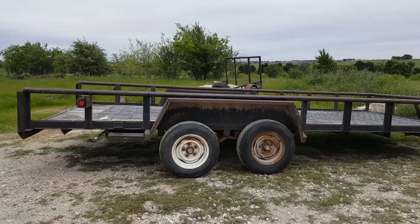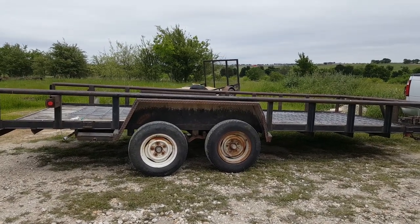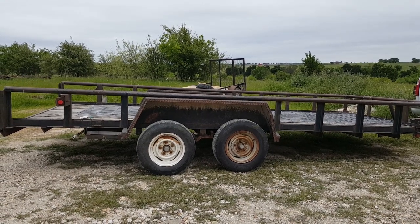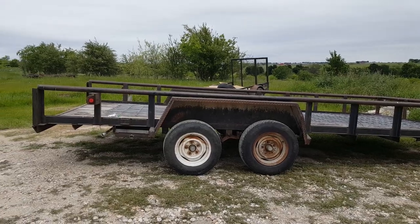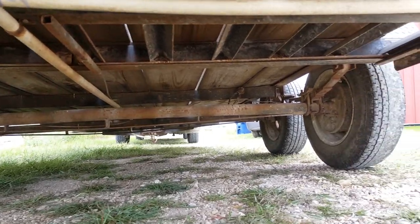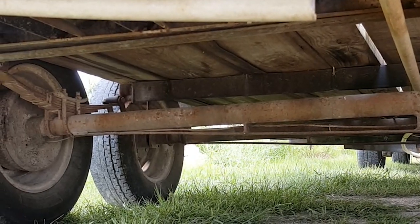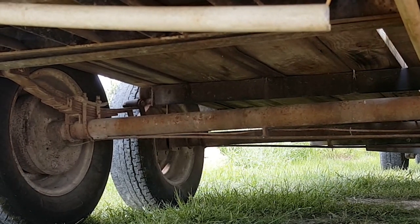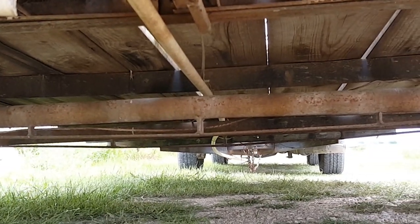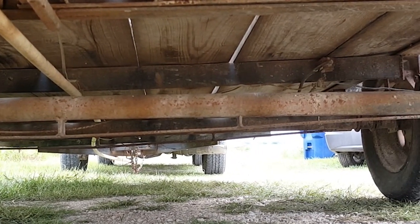Don't judge me on that — this trailer's had a pretty decent life. My dad bought it like 25 years ago, and about 20 years ago he put a Ford 5000 on this trailer and it bent the axles. One of the neighbors told him what he could do is flip the axles around so that the bend is going up, with that flat bar on there, making it kind of like almost a truss. So we've been running this trailer for the past 20 years with it set up like this and it does pretty good.